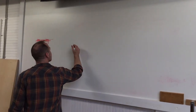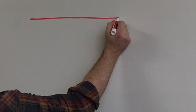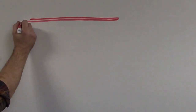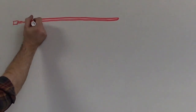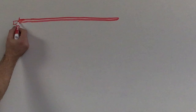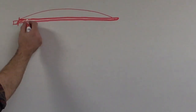All right, so you've got a rod that goes this way, you heat the end up and bend it, and it goes all the way back. One extends, and you cut threads into this side of the rod. That's where your threads will be cut. Your nut's gonna go on there. And then this extends, you've got a washer, and the washer's pressing up against this side of the rod. And when you tighten, this is gonna bow up. And if it's in a channel, that's gonna try to follow that same way. And that's a single action rod, because when you take it off, it just comes off.